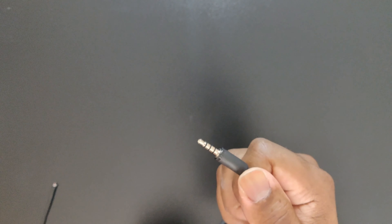If you have gotten your new spool of wire, go ahead and take some off, unwind it a little bit, and cut a piece off. From here you're going to split your cable — it's always going to have a red and a black wire. Now keep in mind this is 14 gauge wire. The lower the number, the thicker the wire is going to be. So if you have 6 or 8 gauge wire, that's going to be thicker than your 14 gauge wire.